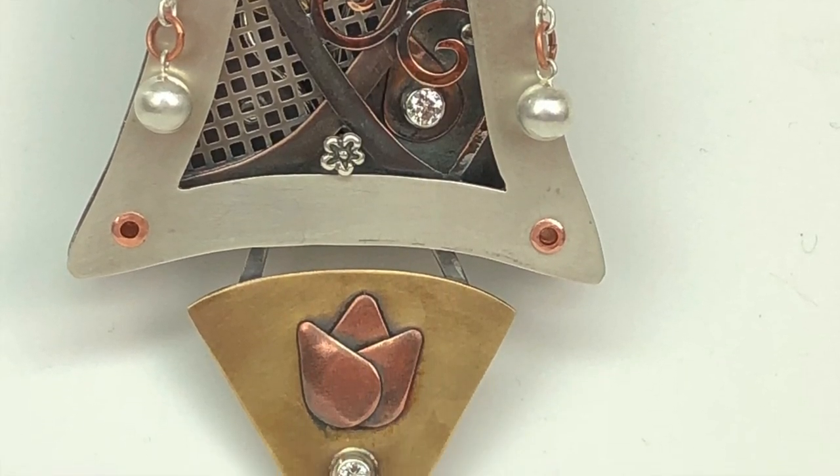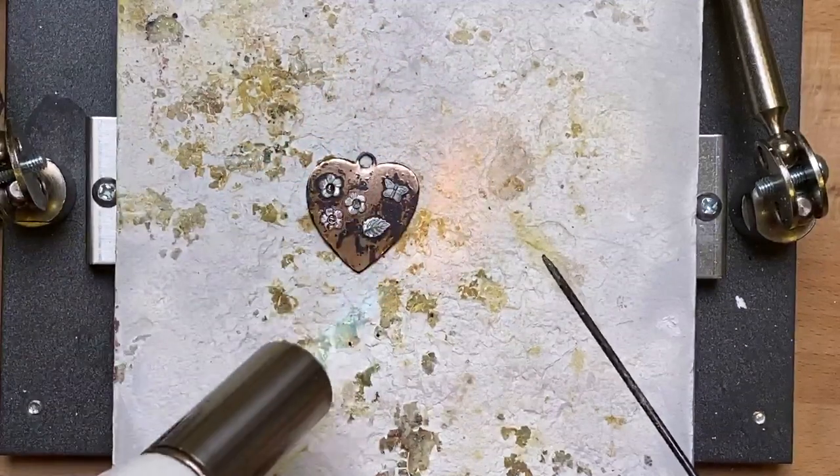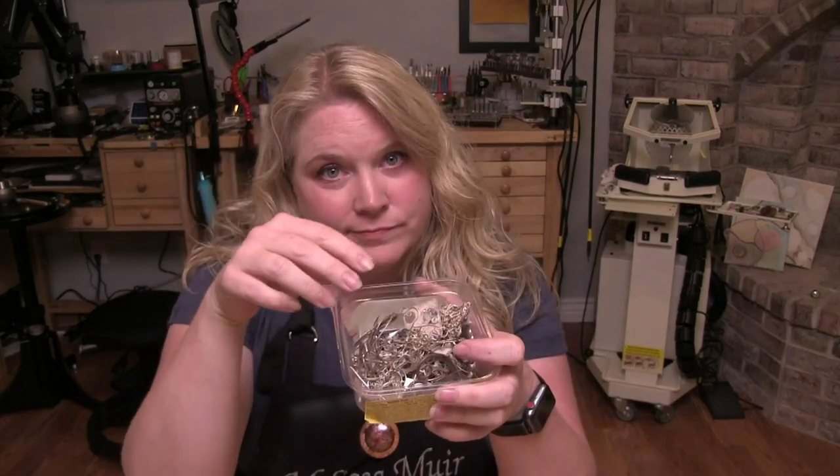You will also need to take into consideration the materials you are using — gold, silver, copper, brass, or any other materials — as each of these metals come with their own set of working conditions. For instance, gold is not conductive like silver and copper; it does not require the entire piece to be heated to temperature for the solder to flow. Rather, you would use a small pointed flame just in the immediate area of work. Copper and silver are both conductive and require much more work to get your solder to flow. If you do not have the proper flame and enough heat — or maybe too much heat — you risk not having your solder flow, creating fire scale, or worse, melting the piece. While there are times the piece can be salvaged, sometimes you just contribute to the scrap pile. Luckily, there are some telltale signs you can watch for to know what is going on with your metal.